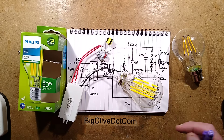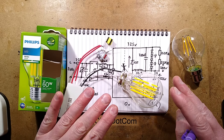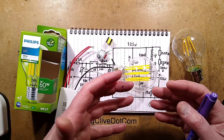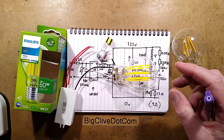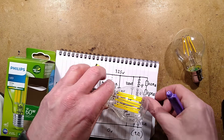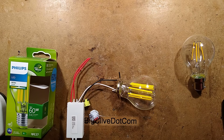The colour rendering index is 80, which is not great but common with LED lamps. With LED lamps you've got blue LEDs stimulating phosphors to add the red and green components — it's not a perfectly linear spectrum, so you don't get amazing colour rendition, just like the early fluorescent tubes. That's the compromise you make for efficiency. But it's a very interesting lamp, well worth taking apart and exploring, and that little twist in the circuitry was quite intriguing. There we go — that is the Philips ultra efficient lamp.